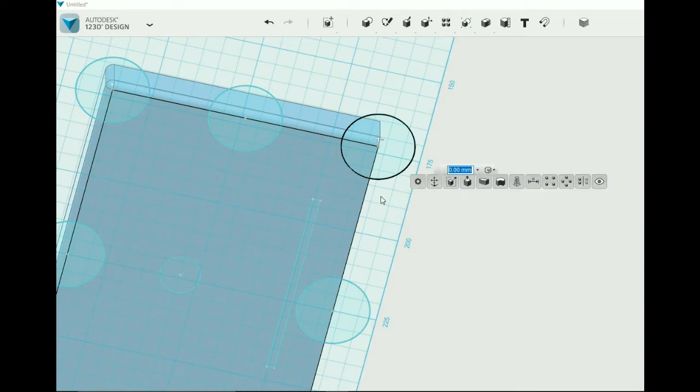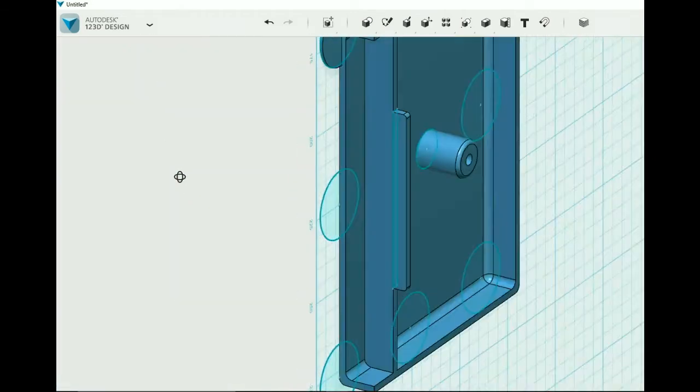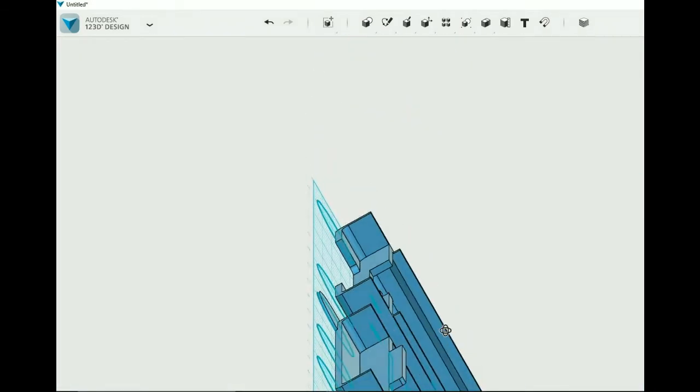and I extrude, and let's do 0.7. And the reason for that being is because I typically print this at a 0.2 resolution, but if I set it at 0.6, it only does 2 layers, and if I set it at 0.7, it actually does do 3 layers. Okay, so now we want to actually click merge, and then just hit enter, and now we have a little disk. Let's see if I can get this.